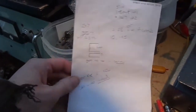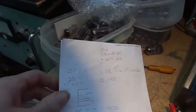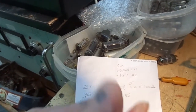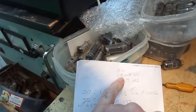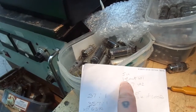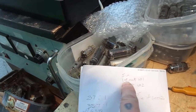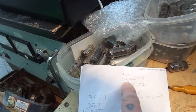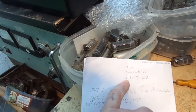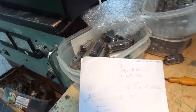I did the maths. Here's how you do it with an unknown output transformer: first you've got to find the voltage ratio. I stuck five volts RMS in and measured the voltage out of each secondary. Out of what I suspect is the 600 ohm secondary I got 1.8 volts, and out of the other secondary I got 0.147 volts.